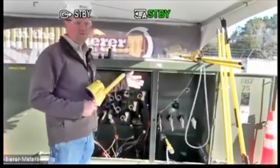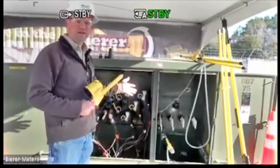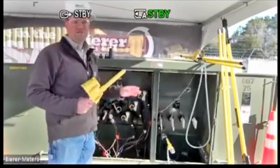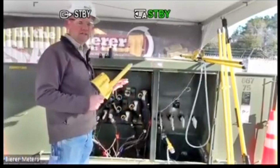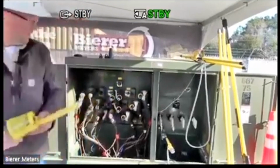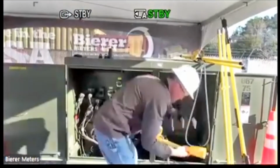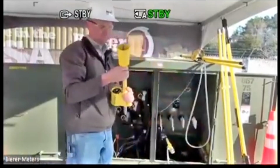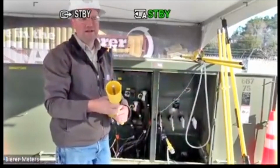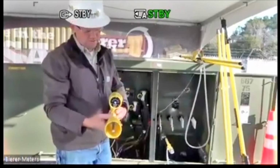So normally in the field, again, you may not have any nomenclature. You may not have any tape on this primary cable, but you need to find this primary cable. All you know is you have it stood off, de-energized, and now you kind of have to sort through the cables, okay? So I'm going to use this meter probe. I'm going to attach my bushing adapter to it. And since this is a 100-volt DC power supply, I can put this meter in the 2 kV switch position.